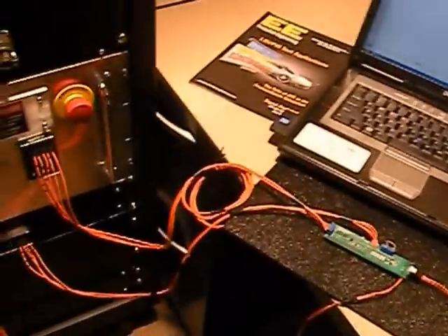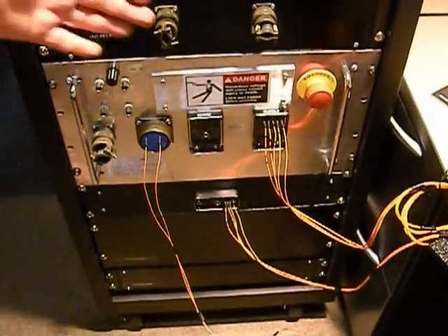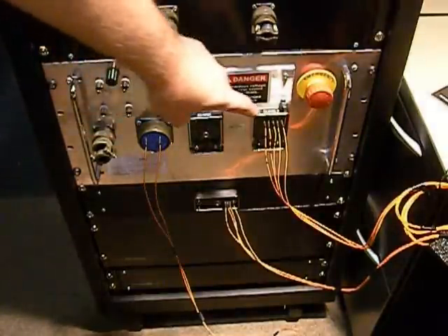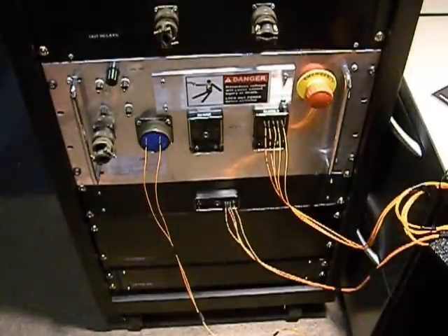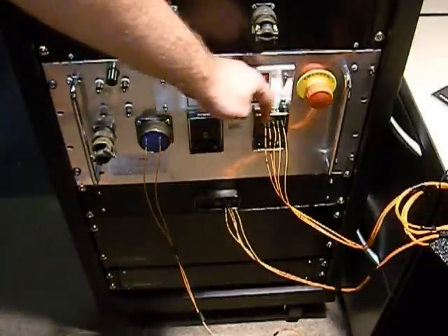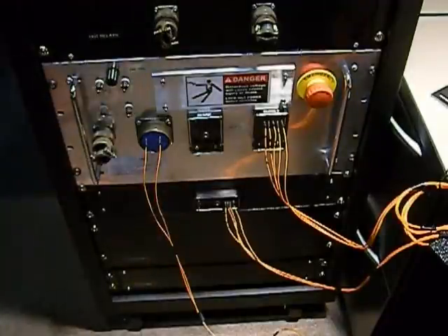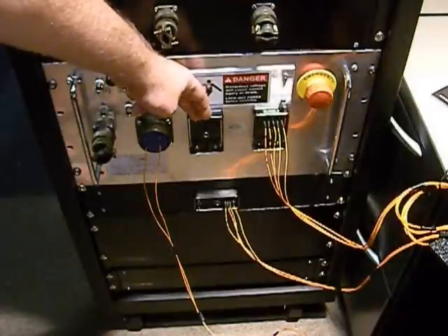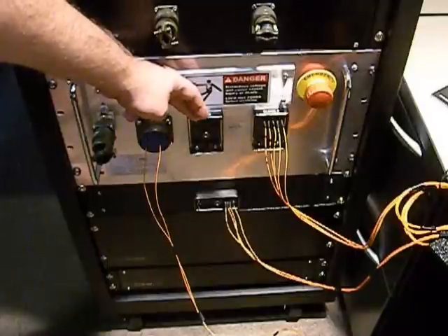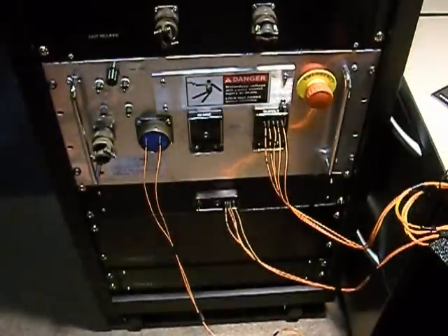From our device under test we have three different sets of leads which go to our BMS test stand. You can see here we have the cell voltage simulator lines — we have five of them connected here, simulating four cells. To tap into the high and low end of that stack we actually need five different wires, one at the lowest potential moving up to the highest potential side of the four-cell stack. You can see we're not using the sense connector here. The system does have the capability to run a parallel set of lines to actually measure the voltage at the device under test.